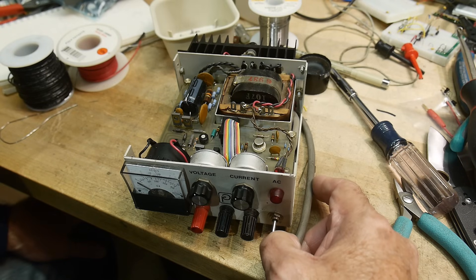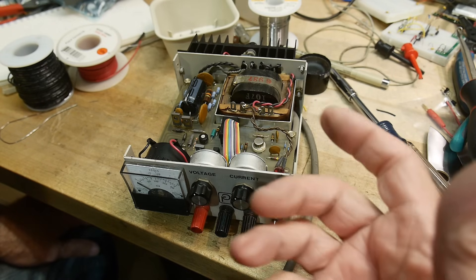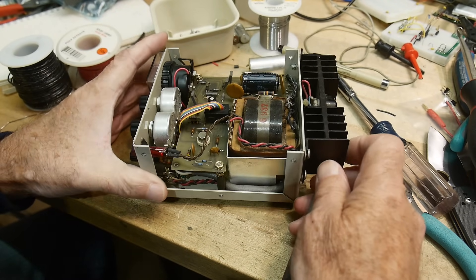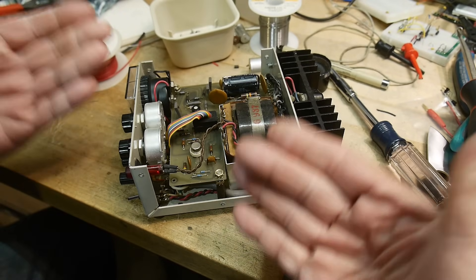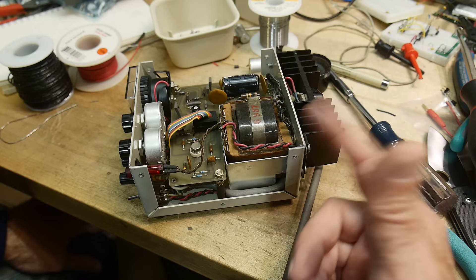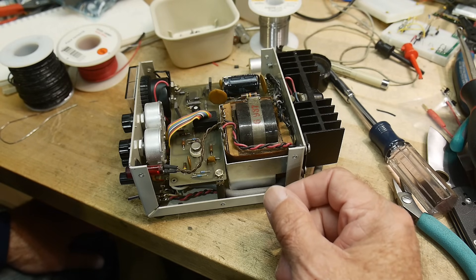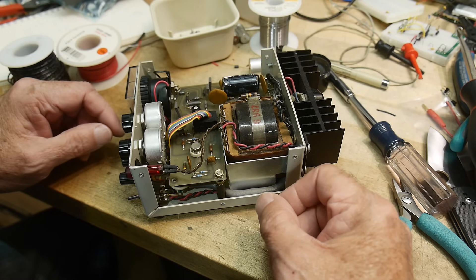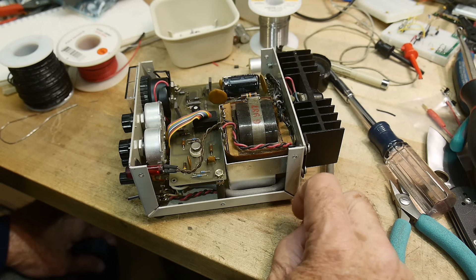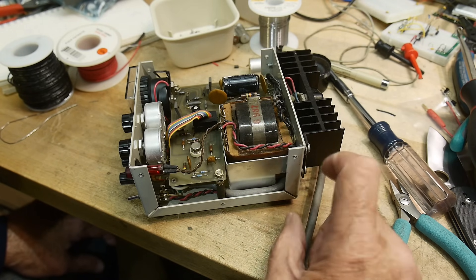I thought maybe I put in good caps with better ESR and they were drawing a little more current with no load on it. I replaced the fuse - it blew again. I tried a third time to see where the arcing was, maybe get a visual clue. I replaced the fuse with a slow-blow so it would last a little longer. It made terrible arcing sounds again, then went quiet. I never saw where the damage was, but I noticed this transformer was getting hot.